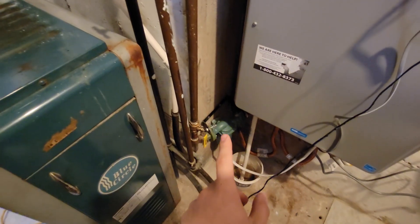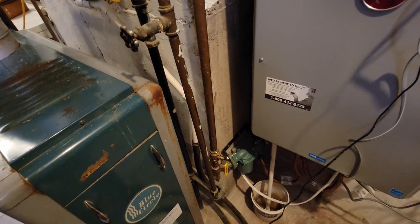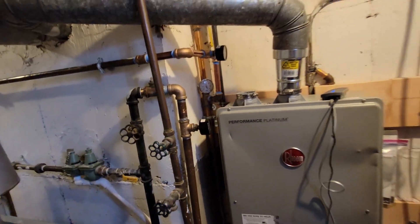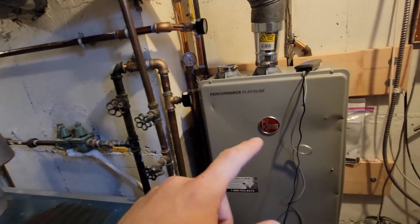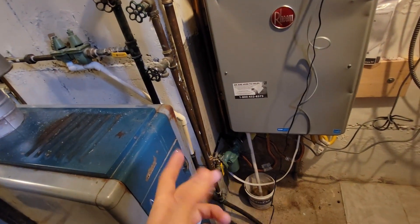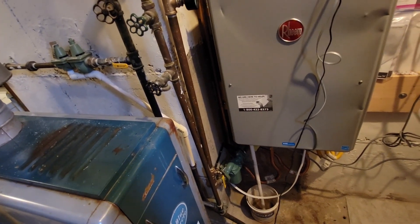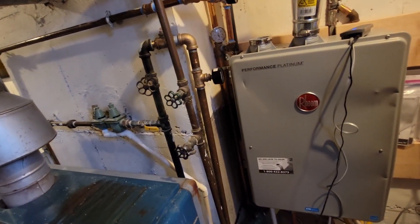Right now the needle is really just a tiny bit shaky because I did put a circulator — a water circulator — with a crossover valve in the bathroom, the furthest away, so that there is constant hot water. A lot of people complain that it takes too long for hot water from the tankless unit to reach the bathrooms. So I put a Taco standard water circulating pump from Home Depot, and I ordered the crossover valves on Amazon.